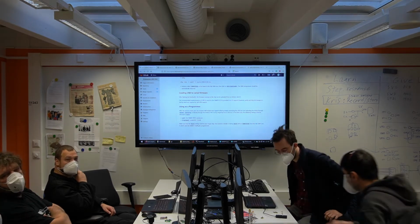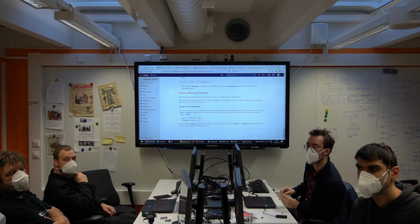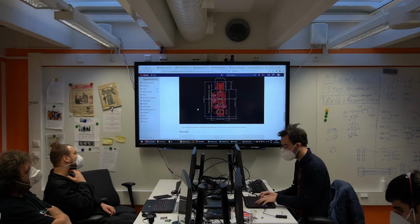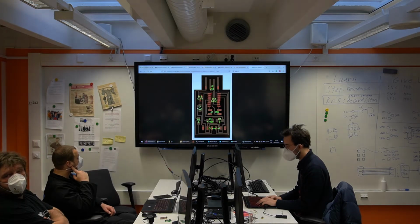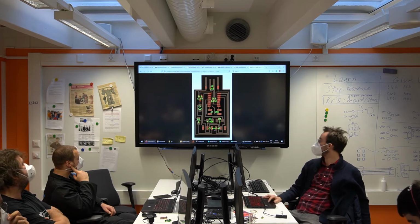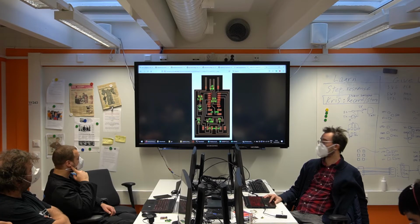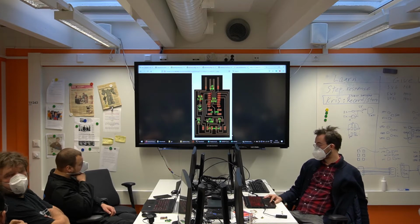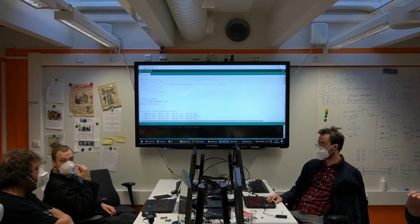Yeah. So we could make a fork of this one and use it as an FTDI instead of as a UPDI programmer. Absolutely, yeah. Because for example, right now there is a shortage of FT230, which is like 3-4 months. Yeah. It's impossible to find. So actually we could use this. It's easier to solder, way easier, because of this spacing. So this is the reference design for that. It's just amazing. Neil's board, which gives you 6 pins. The standard 6-pin FTDI. Okay, that's correct. And we use exactly the same code. Okay, problem solved.